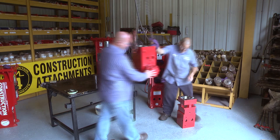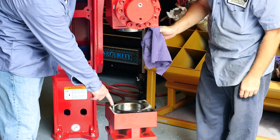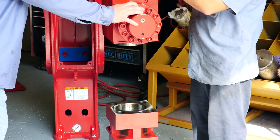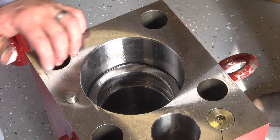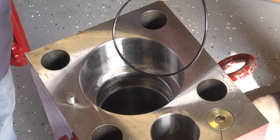Once you have cleaned your piston, your control valve, and your cylinder, it is now time for reinstallation. Make note that there is a dowel pin between every section and that dowel pin must be in place in order to keep the sections straight and lined up. Lower the cylinder down onto the front head — make sure the o-ring is not pinched or mashed for the grease line to come to the bushings. Note that underneath the cylinder bush there is also an o-ring that just lays in the top of the cylinder before the piston and upper bushing are put back in.